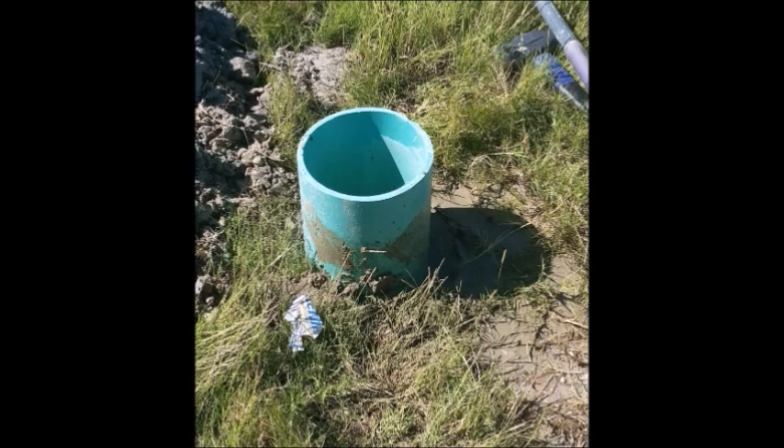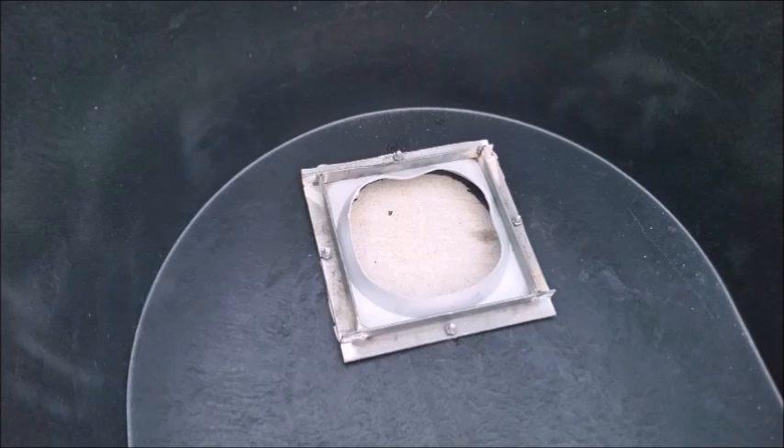Next, we assemble a mud tank. As an alternative to building a portable mud tank, one may place polyethylene sheeting on a cleared ground surface and make a mud pit by supporting the poly some distance from the borehole with stakes, such that a small pond is constructed. There is never a need to machine or hand dig a mud pit in the ground. I use a 120-gallon stock watering tank constructed of recycled plastic, normally paying about $70. I take a reciprocating saw and cut a hole in the bottom to accept a roof jack to seal against the surface casing. These portable tanks are fine if the borehole is less than 6 inches in diameter and less than 50 feet deep; a polylined pit can be used if the depth or diameter is greater.